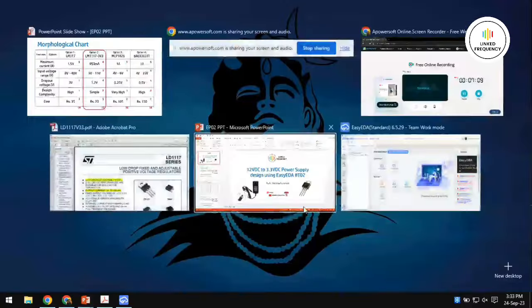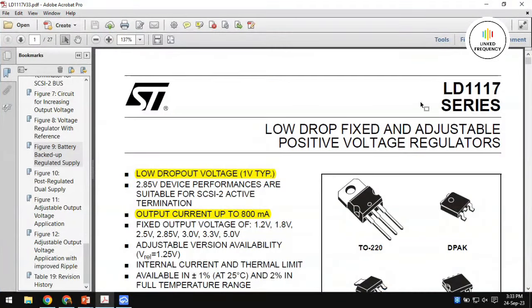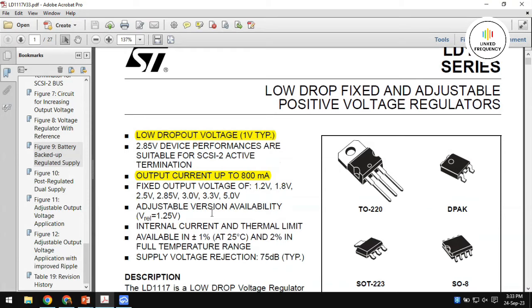Of course, I'm using datasheet analysis. You can see here, this is the LD1117 series datasheet, because we have multiple options under the same regulator IC number. That's why it is a series. It is claimed to be a low dropout fixed and adjustable positive voltage regulator. We are using only the fixed one. Adjustable is not required for us. Low dropout, why? Because it has a typical 1 volt dropout, which is very good compared to the LM317. Output current is up to 800 milliampere as mentioned in the description or feature section. But if you go to the maximum current section, you will see it is up to 1.3 ampere.